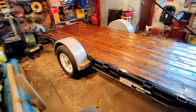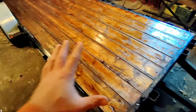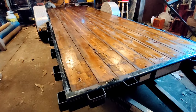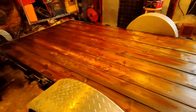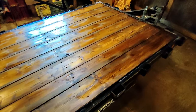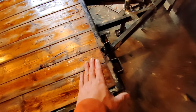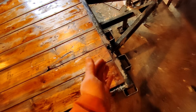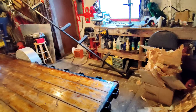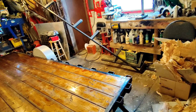Okay guys, got it all stained up. This is the first coat - I'm going to put a second coat after this one soaks into the wood. It's looking beautiful. While I'm waiting, I'm going to take the wire wheel and clean up some of these rusty spots. Then I'm going to take some rust-coat gloss black paint and touch up those little spots. There's a whole bunch of pockets - the rear one and the sides - little pockets where they're a little rusty in some spots, so I'm just touching up everything.